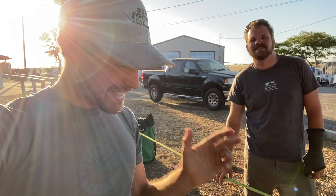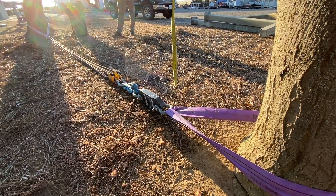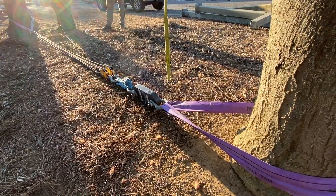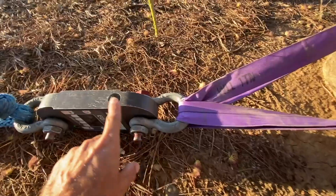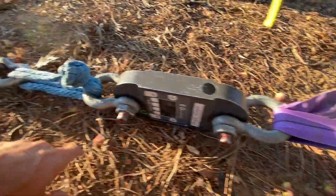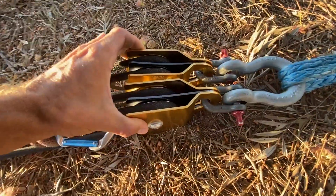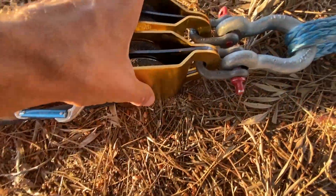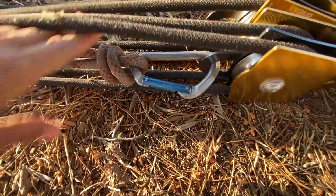Here's a quick video showing us testing our new 81-to-1, or Slack Snap 1.0. We're testing the maximum strength we're going to get, just from tree to tree. We have our dynamometer, oriented with the span set, and technically four — two on each side — SMC pulleys. That's how we connect it with little shackles to a big shackle, and then it's terminated at this point.